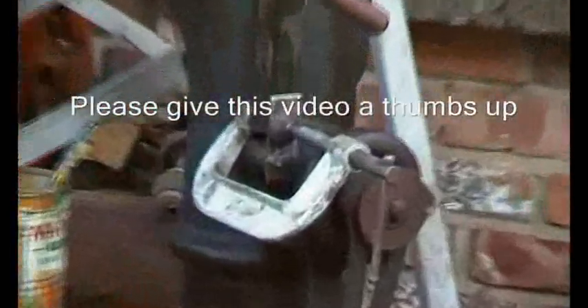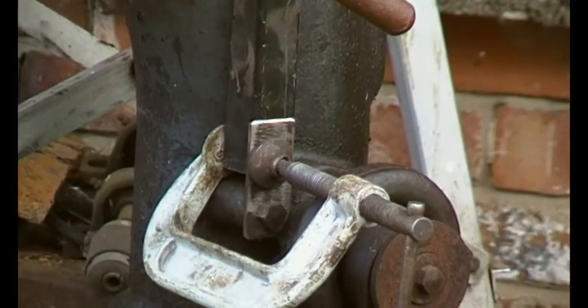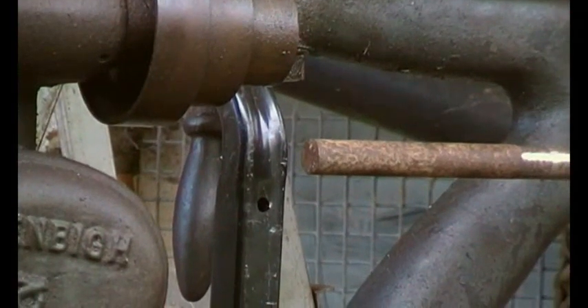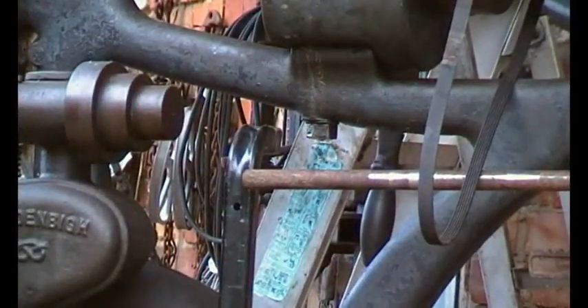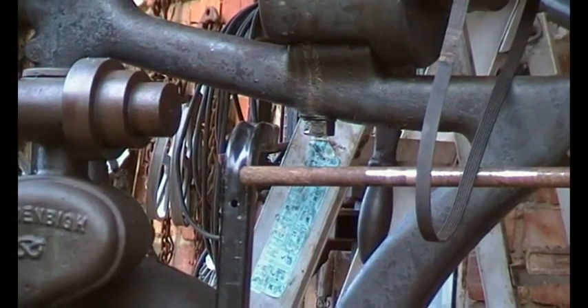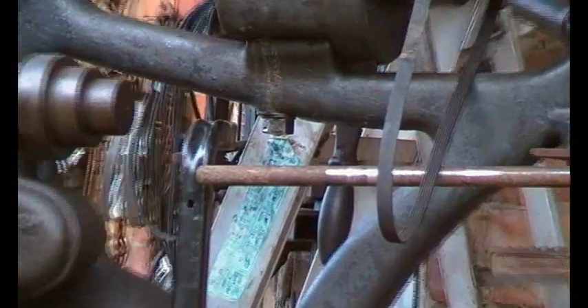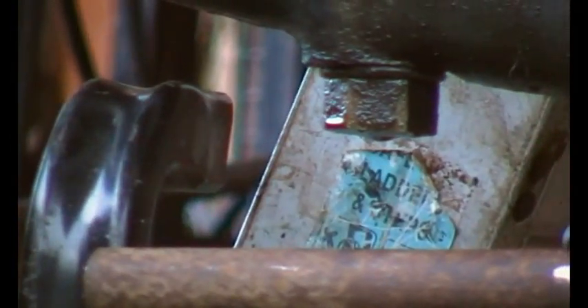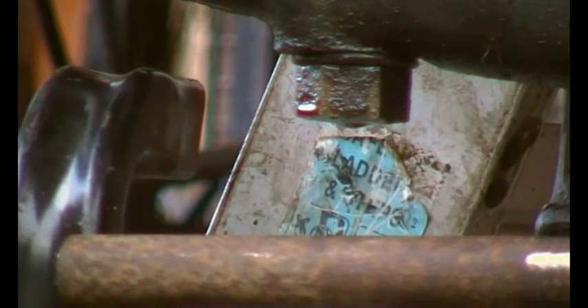So I've just made that little bracket there, picking up on that bolt, and that can be welded to this upright. We've used the existing bend on that piece of steel, that box section. Now we need to make a bracket that goes between the top of that bend and the big nut that holds the gearbox on - just there. Not quite at the same level, but we can adjust that on the bottom bracket. We can move it up a sixteenth or an eighth of an inch. Let's make the next bracket.